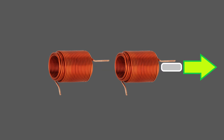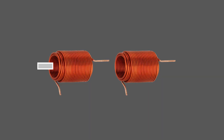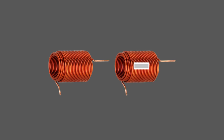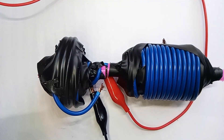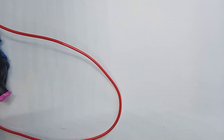This is going to complicate things slightly. The obvious complication is now we basically have twice the components to deal with. The not-so-obvious complication lies in how these sets of components are going to interact. As the projectile comes out of the first coil, the second coil needs to begin dumping its power right as the projectile moves into the correct position for maximum acceleration. If the coil fires too early, the projectile doesn't get influenced by the magnetic field in the strongest possible way. If it's too late, the coil will pull back on the projectile and slow it down. Having a human try to switch the coils at just the right time is basically hopeless.